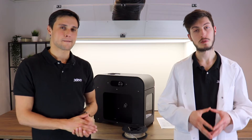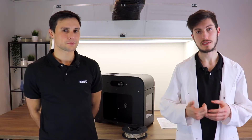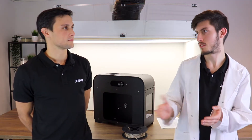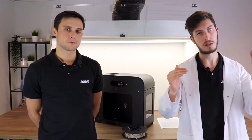In this case it will be PEEK. So Louis, can you explain something about PEEK? Of course. PEEK is a high performance plastic — it's called that because it has outstanding properties, including very good mechanical strength and resistance in general, as well as very good chemical and thermal resistance. For example, PEEK can be used continuously at a working temperature of around 250 degrees Celsius, which is very high. And in order to process and melt PEEK, we need to work at very high temperatures, around 400 degrees Celsius — again, very high for a plastic.